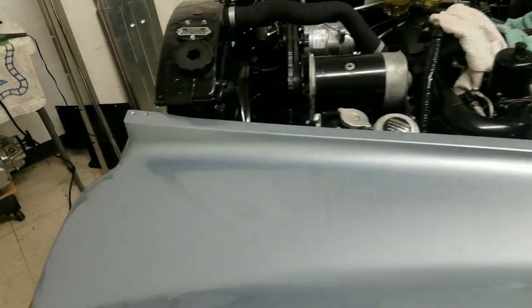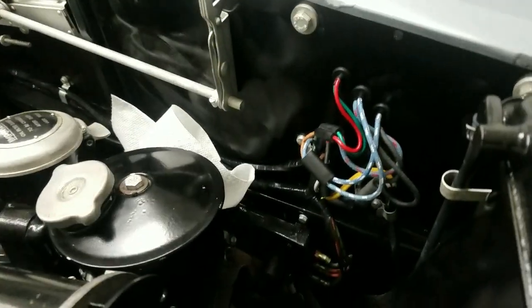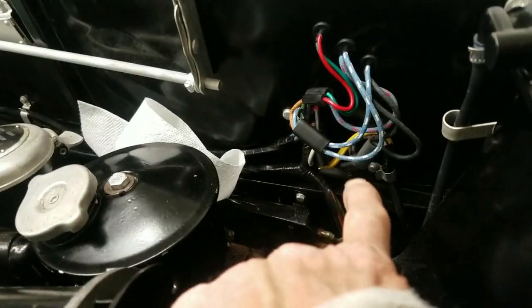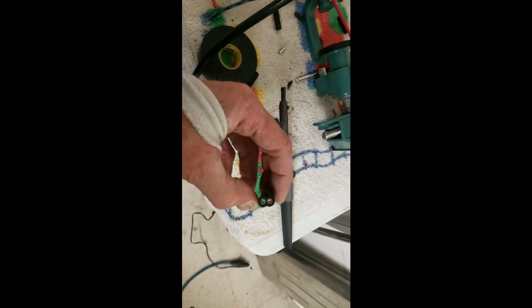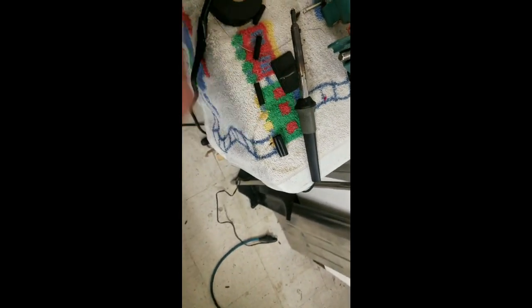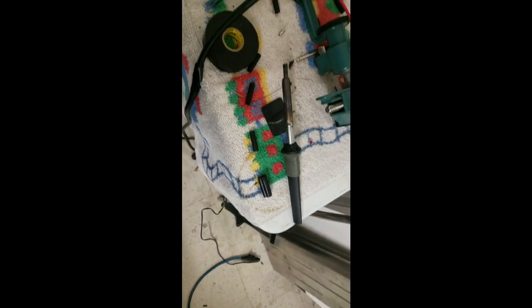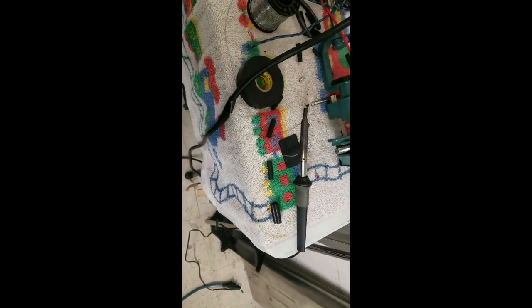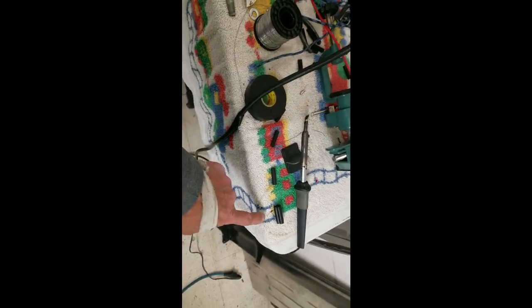The other thing is I put my wires in and ran them through the holes. You can't really see them, but I ran them through the holes up there. You can see I brought them through here and got a nice wire bundle there. Now for the ground, there are triple connectors - they use triple connectors. The Cloud II uses a lot of singles, but these triple connectors are insulated going through, so every one of those are independent, and that cleans the wiring up. The Cloud IIs and Cloud Is have a lot of singles where every wire goes into each one. They make a gray one that you use for ground - they're all connected and on the inside it doesn't have rubber separating them, it's just one piece of metal. So I use that for the ground, which cleans up things if you look at your wiring diagram.